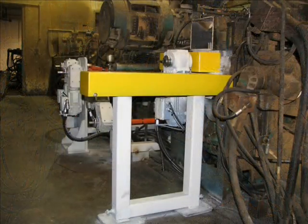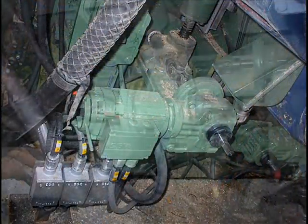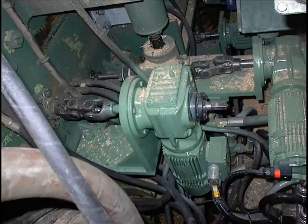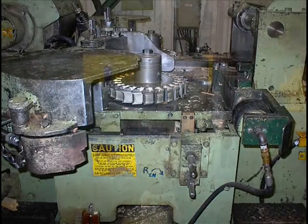Top and bottom cutter heads. Left and right side heads. Bed plate, and all additional axes. To increase accuracy, the encoders on the servo motors operate in closed loop with the linear rulers.